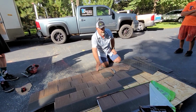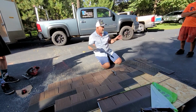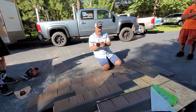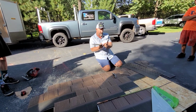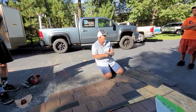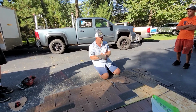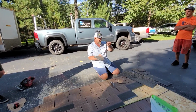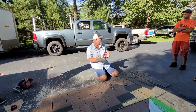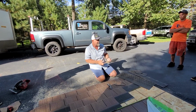Simple. And we've talked about this so everybody hears me here. On the valley, you're doing a W metal, a brown. I want this cut about 1/8 of an inch from that rib, if not touching the rib, okay? We're not going to do an open valley, which is nice because it's going to close and look clean. The rib is the most structurally supportive, the hardest part of the metal, so it's not going to get damaged by hail, but that'll give it a closure.